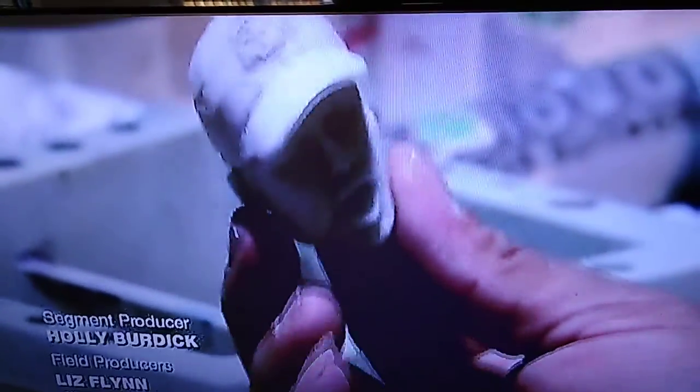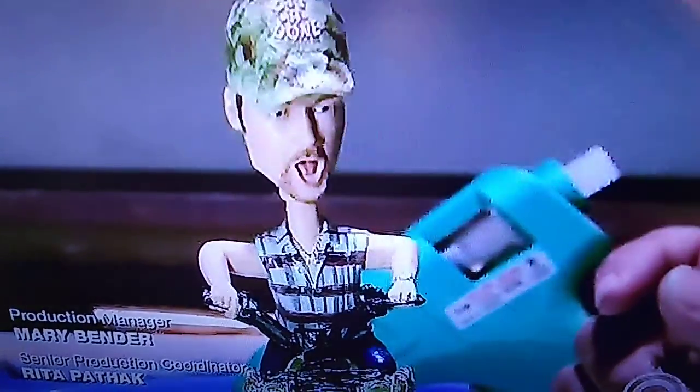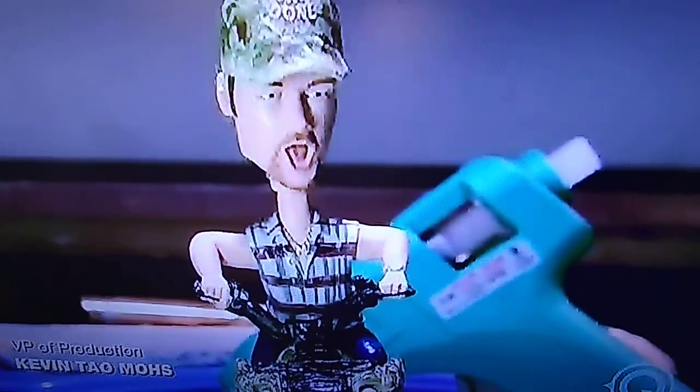It takes another 4 hours of printing in the same printer to make a prototype of the bobblehead body. When both prototypes are finished, they're used to cast rubber molds that can be used to cast hundreds of bobblehead parts that are all exactly the same. An artist paints each bobblehead by hand to make sure every nook and cranny gets the right color. When the paint dries, a small spring is glued to the inside of the head, and this bobblehead is ready to bobble.